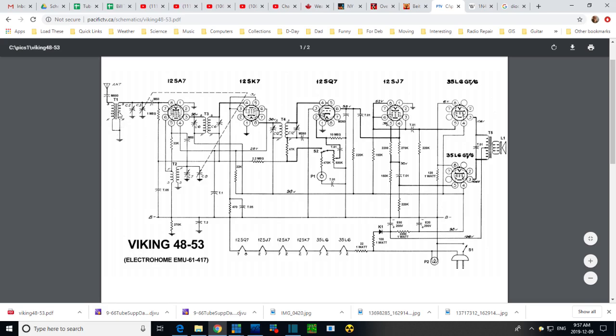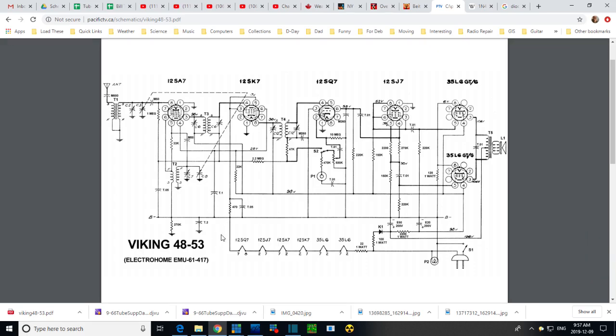Well, it would still be connected to the chassis. The chassis has a lot of capacitance against all these parts in here. Because of its proximity to all this stuff, it's kind of connected through a fake capacitor, a tiny capacitor, and a super huge resistor. You could think of it that way. Okay, so that's my theory. Remove these, signal level drops. Radio still works. B minus risk goes up. Shock hazard risk goes up from the chassis.